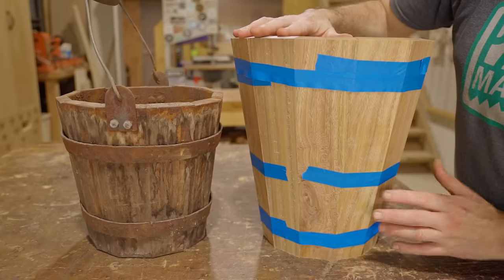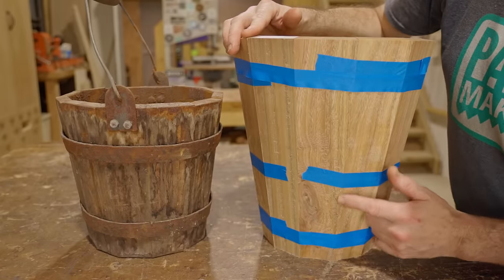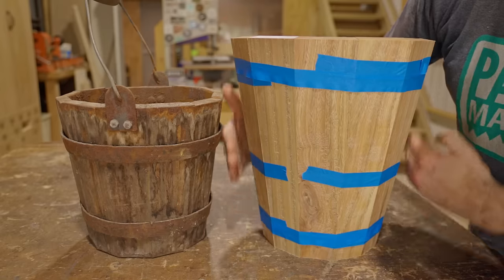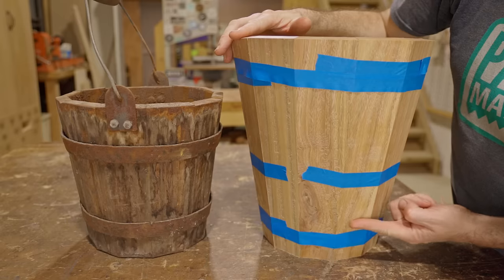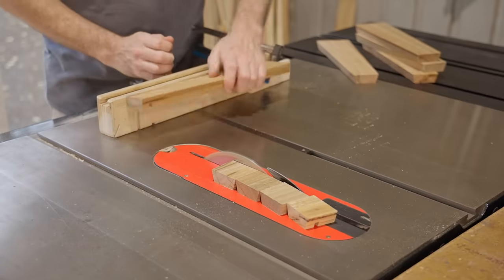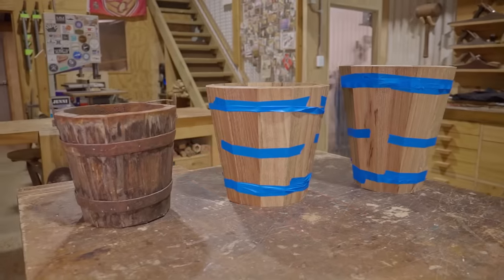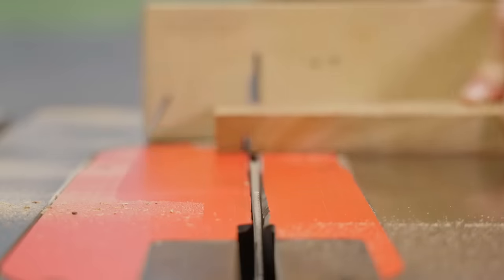I'm not 100% happy with it — I think it's a bit tall and a bit thin at the bottom. If I were to do it again I would have put the tapers at two degrees on each side of the stave rather than two and a half degrees, giving the sides less of an angle. Because I think it's too tall, I'm going to take a couple of inches off the bottom, which I think will look a lot better — the original bucket has similar angles and the same base size but just looks much better in proportion not being so tall. I had to set the bevel gauge to two and a half degrees to keep the ends even and the stave symmetrical. I did one first to see how it looks — much better — so I'll do the other one and then cut the grooves for the bottom.